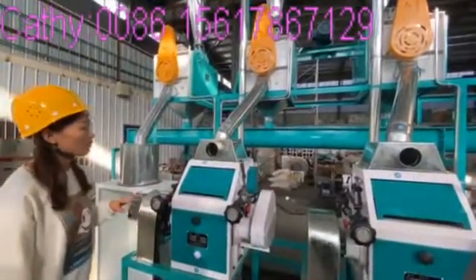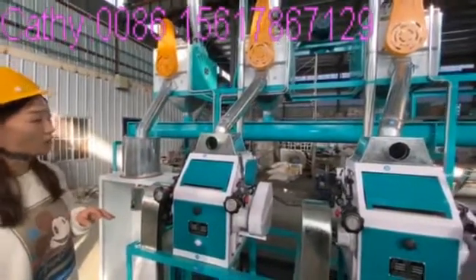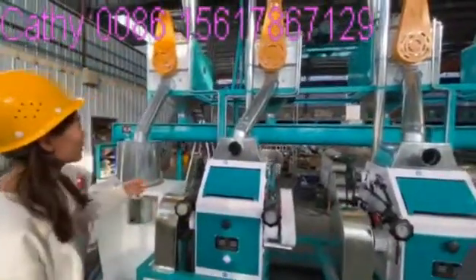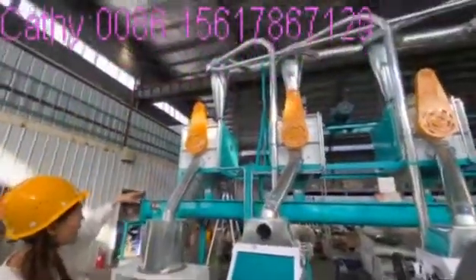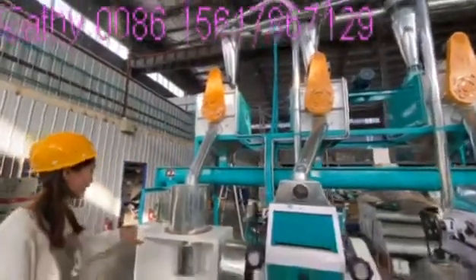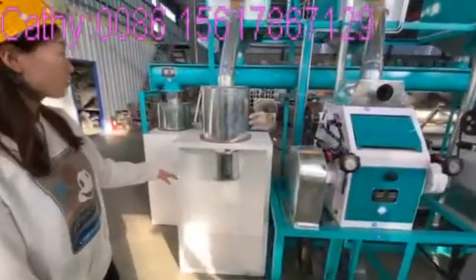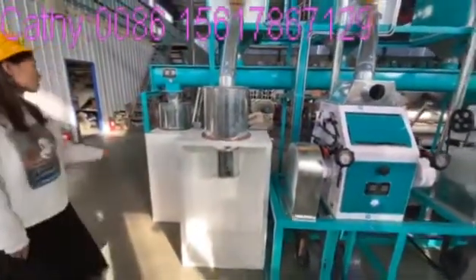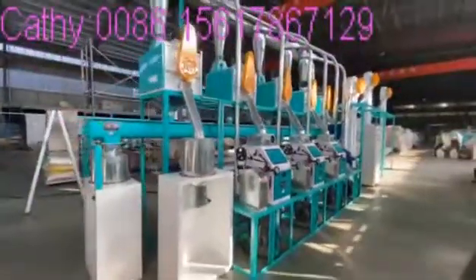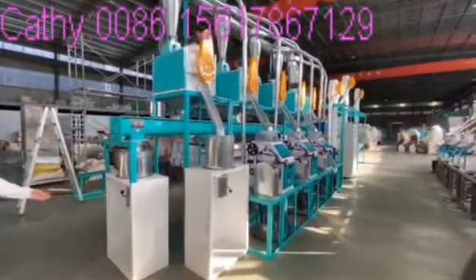After the second grinder, into the brush again to remove some bran and get some small size flour. The next part is the final grinding. The final grinding produces flour that can meet customer demand. After grinding, into the bran brusher. This part is the bran packer — it collects some animal feed from the bran. And this packer is for flour. The customer can find the finished product output from this unit.